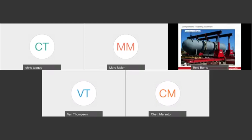And next, we've got the header beam links and the rigging. These can look like a variety of different things, but typically you've got some type of burned out plate or weldment that takes the load from the rigging and puts it to the center of your header beam so that load can, again, the goal is getting the load to the gantry legs.